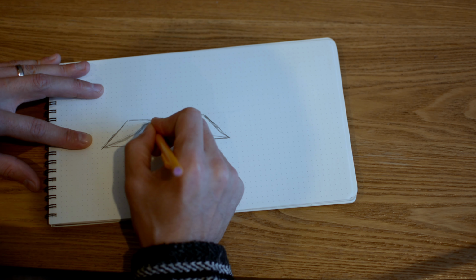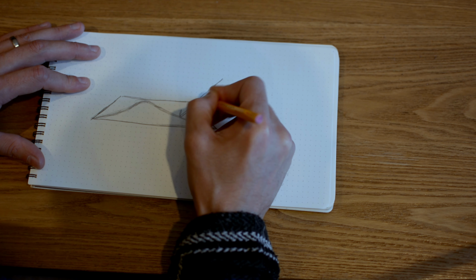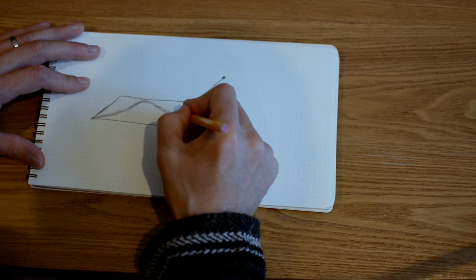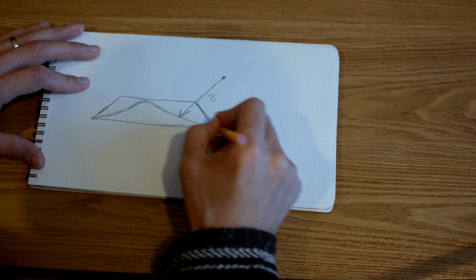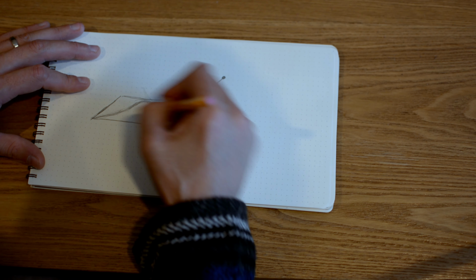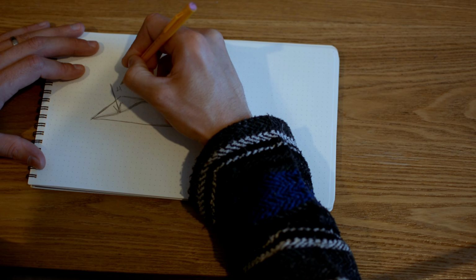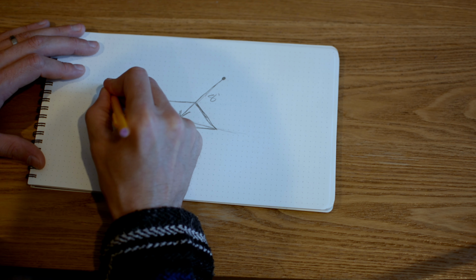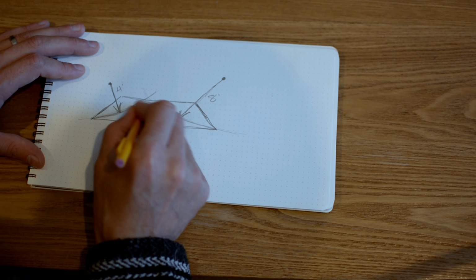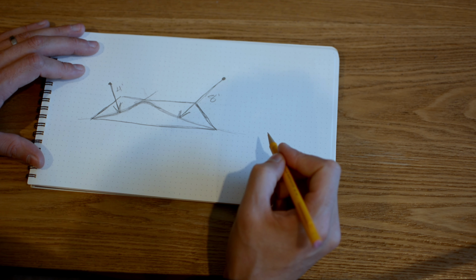What I think is a good way to do this is going to be for this radius to be 8 feet. So set a point, pull a tape measure, put a pencil on the end of the tape measure, and draw a circle 8 feet. It kind of looks like this on the side of the piece of plywood that we currently have. Now on this side, I want one to be 4 feet, half the size. Put the point, pull the tape measure, draw a circle, and then we'll just sort of round out the top however makes sense. And we may end up having to shave some off. I'm not real sure exactly how steep or sharp that's going to be, but that's the general plan.